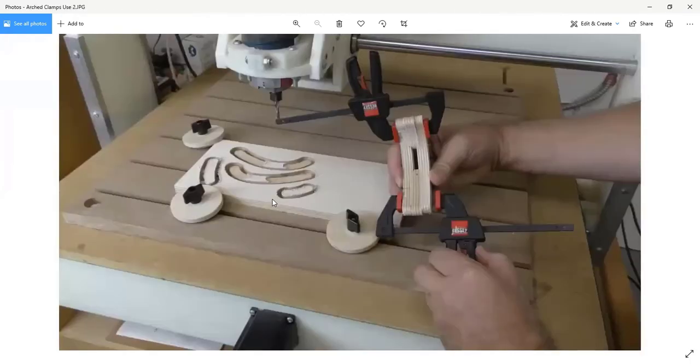When you're working with your tools, these benchtop CNCs are generally not equipped with tool changers. So to change a tool, you have to have a separate program, and you have to stop and set new tools. It's a workable solution, but it's not fast. So very often, if I need to cut out a pocket or make a hole, I may have to use a smaller bit for that.